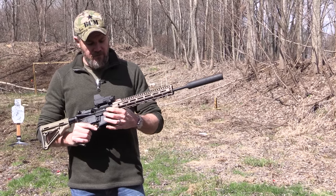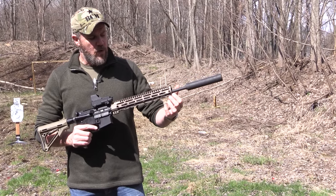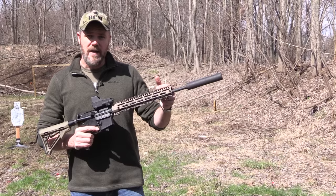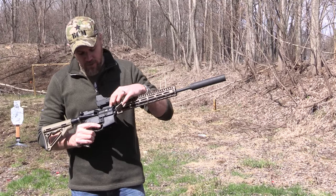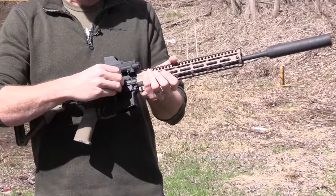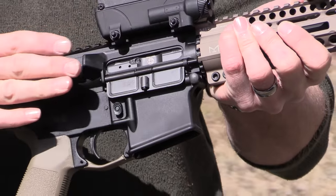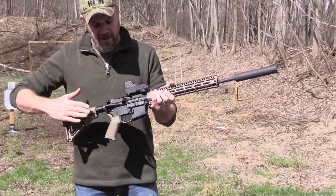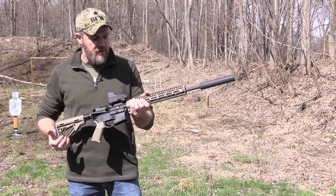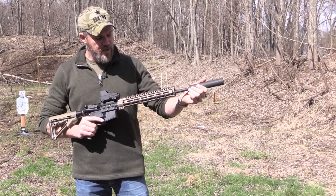When you fire a 5.56 or .308 cartridge, as the bullet passes down the bore, some of the gas is tapped off. In a direct gas impingement rifle, it comes back into the bolt carrier. There's a little expansion chamber where the vent holes are, and the gas expands, pushes the bolt away from the carrier, and the whole carrier group springs rearward and cycles, then goes back home stripping a fresh round from the magazine and readying the gun for the next shot.